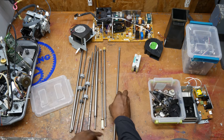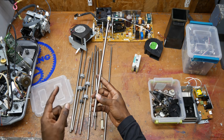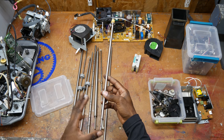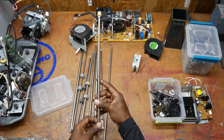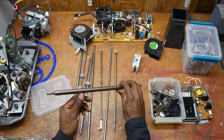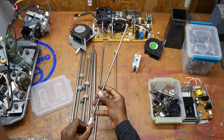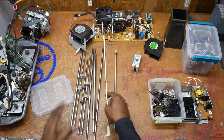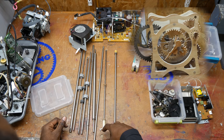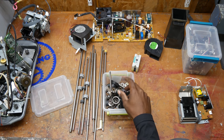As you can see, there are quite a large number of steel shafts and they vary quite a bit in size. If I have measured carefully enough, there seems to be a mix of both metric size shafts as well as US customary — some shafts I'm pretty sure are 5/16ths and not 8 millimeter. You want to be sure you match up your bearings accordingly. I recently finished making a clock where all the gears are made out of wood — I'll put a clip up so you can see it running. It keeps time and it was a really fun project. If you'd dare to take on something like that, I have plans on my website.